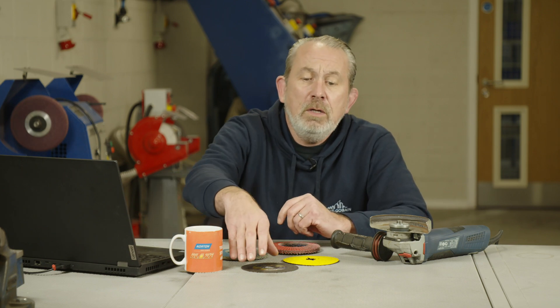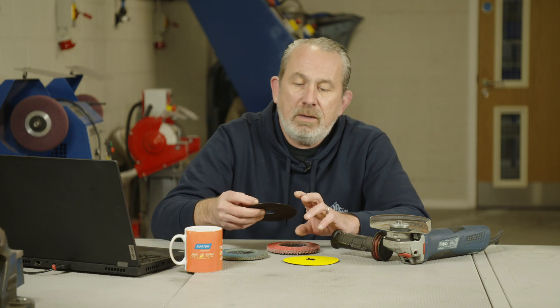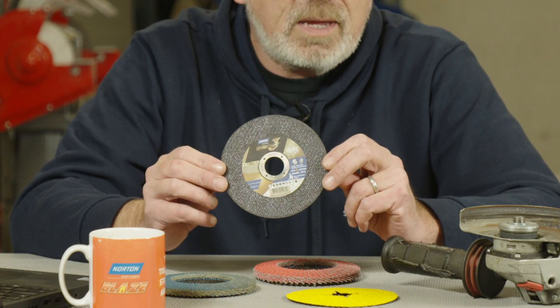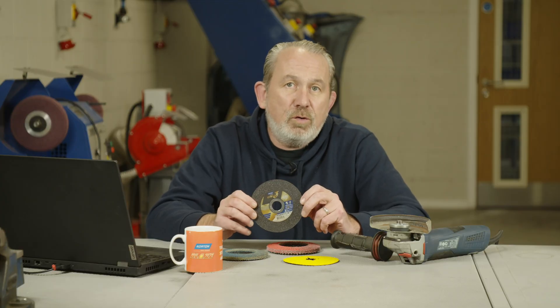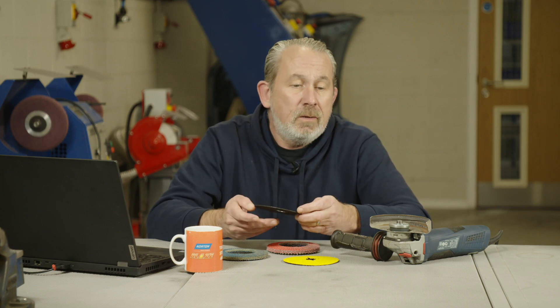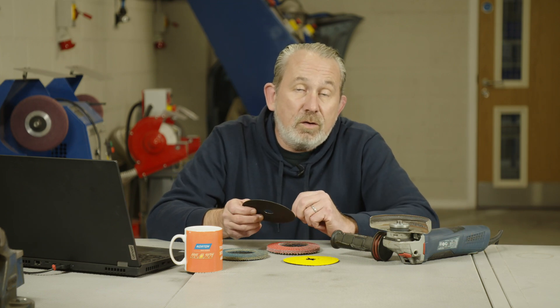If you can reduce that bluing on the stainless steel, that's going to be an advantage. If you're using a cutting disc to cut your stainless steel, the best thing you can do is cut quickly — get through the material as fast as possible. To minimize bluing, I recommend the Quantum 3, which is a fully ceramic abrasive that cuts much quicker than a conventional aluminium oxide disc, so you avoid staying inside the cut too long, creating friction and heat. Combined with a powerful angle grinder — nearly a two kilowatt grinder — the cut gets done very fast, reducing the chance of burning.